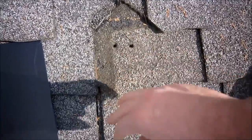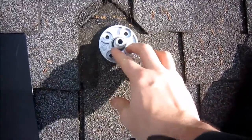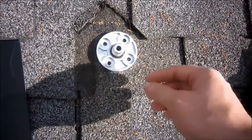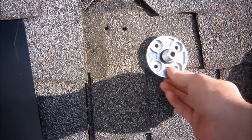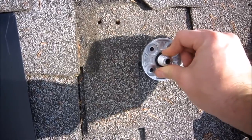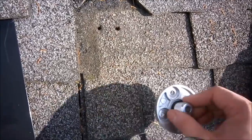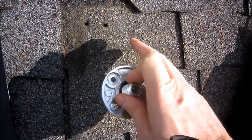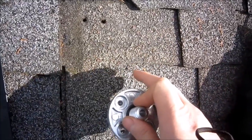Now I've got a clear area for that footing, and it's going to come in on top of that hole with room to lay flush on top of the shingles. Every once in a while you get a hole that's slightly hanging off the edge — if you get really too near it, you fall into a position where it's wobbling too much and you have to cut away and go on the layer of shingles underneath. The lower you go in the layers of shingles, the more likely you are to encounter nails when you try to slide your flashing underneath. So if you can avoid it, stay on the top surface of shingles.